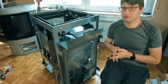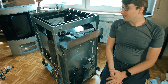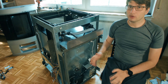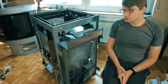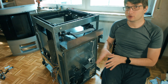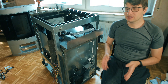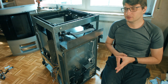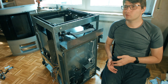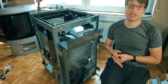These are the goals I'm looking for with this printer. We have two challenges to solve on this project. First, the old electronics were very outdated. The printer was functional electronically, but I basically scrapped all the old boards because the software is simply outdated. Stratasys doesn't update their software for old machines — they push you to buy new ones. The old software would be usable but very limited compared to the modern slicers we have nowadays.